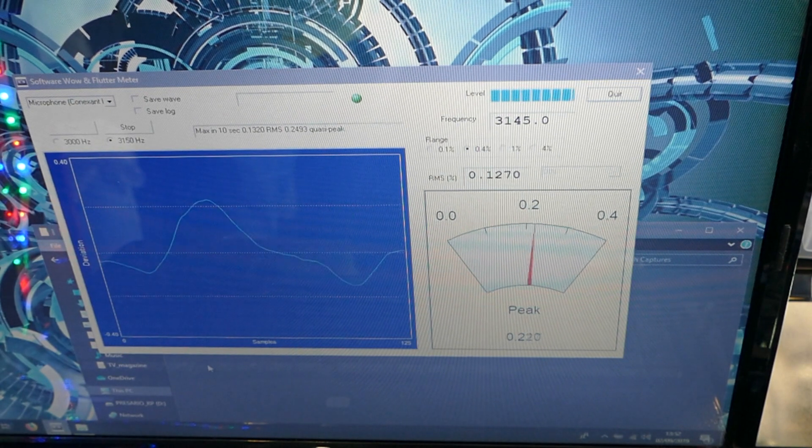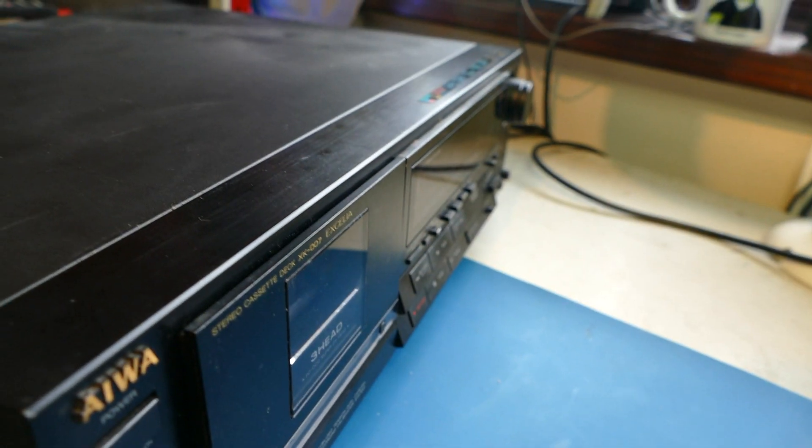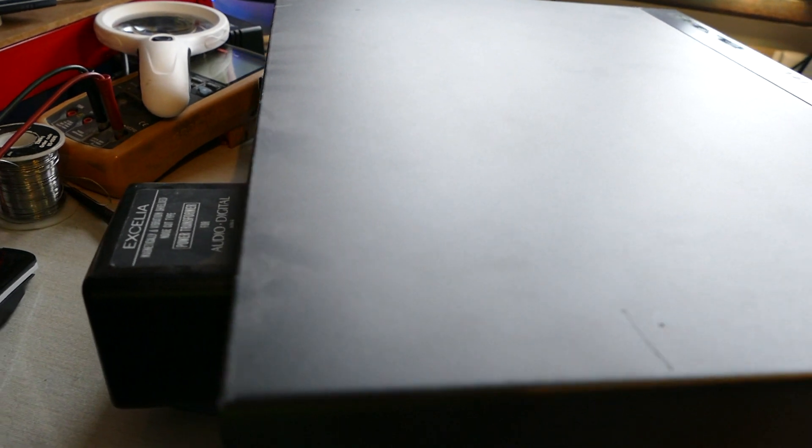I'll reassemble this machine and put it back in my system for some final tests. Before we leave, I wanted to show you the huge power transformer which sticks out the back - it's an impressively bulky and heavy cassette deck. Though the wow and flutter readings are hardly any better than they were with the old motor, I have confidence that there should be no further issues with this machine. I'll see if I can source a better test tape for further readings in the future, and there's a possibility that higher quality audiophile grade belts would give a tiny improvement. I hope you've enjoyed working on this impressive cassette deck - please like, share and subscribe for more content on audio and video technology. Bye for now.